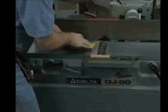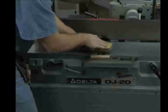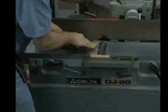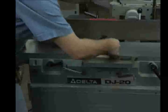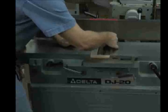I'm going to do a little bit of 8,000 grit just for fun. Because this takes so little time, I mentioned before, 1,000 grit really is plenty for a joiner. But I've played around with it a little, just do a little 4,000, a little 8,000, literally just for a few strokes each, and the wood comes out glassy smooth. It's for such a small amount of time. Sometimes it's worth something like that just to make you feel better.